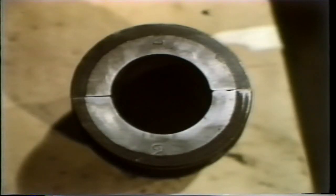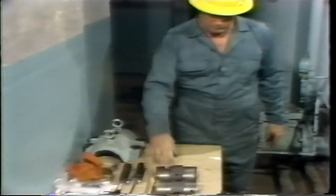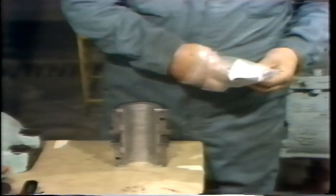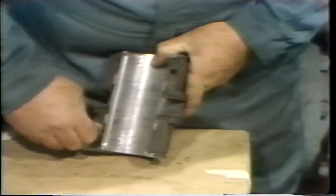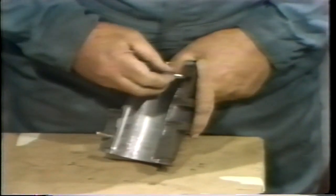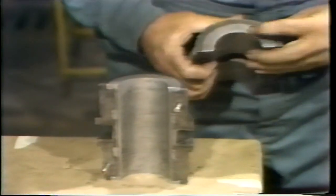What's required here is to reassemble the two bearing shells in order to measure the inside diameter of the assembled bearing unit. He sets the top housing aside, then puts the two shells together, paying careful attention to the identifying marks to be sure they fit together the right way. In this particular bearing, holes are provided in the two shells, and the manufacturer provides alignment dowels which can be placed in these holes when assembling the bearing for the purpose of measuring its inside diameter. The workman takes the two alignment dowels and places them in the holes provided in the upper shell, then takes the second shell and places it into position over the dowel pins, taking care that the two marks match up.